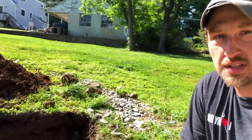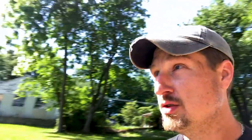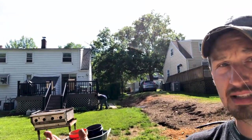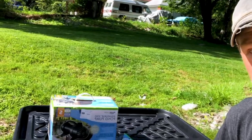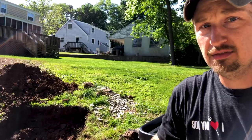Good morning, everybody. This is Drew from Atlantis Water Gardens, and today we are in Morristown, New Jersey. We are installing our front door falls, paver patio, retaining wall. This is going to be perfect for a table, a couple of chairs — not too far from the house, probably 50 feet from a nice deck in the back. We're installing this front door falls, which consists of the Aquascape 45 basin, Aquasurge 2000 pump, inch and a half plumbing. We're going to recirculate up through Aquascape's new 12-inch spillway through a series of two cascading falls, starting at the top and working its way down into the basin, creating a beautiful smaller waterfall nestled right into the curve of the existing landscape to take advantage of that slope.